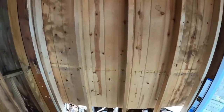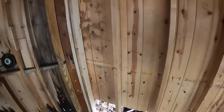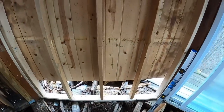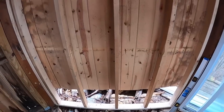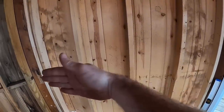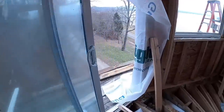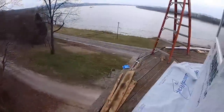All of this, I have determined, all of this I'm gonna take off, put plywood on it. Plywood's gonna be much stronger, tie the building together properly. I know this product isn't bad now that I've trimmed it off, but you gotta strip it this way, and I don't want to take it off to strip it and put it back on, because now my distance out on the outside changes.